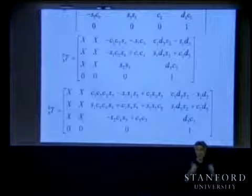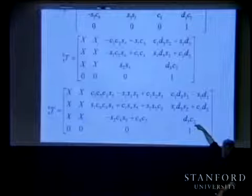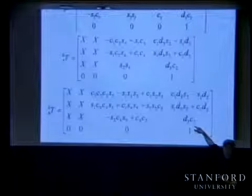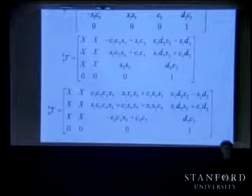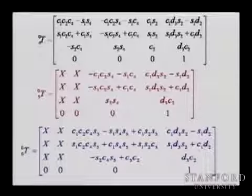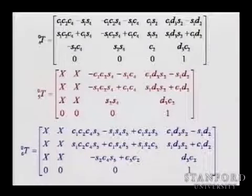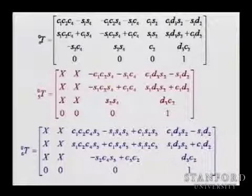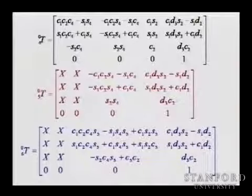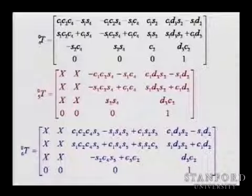You can say I would select X, Y, Z to represent my end effector position. And then for the orientation, what are you going to select? Pick something. So what options do we have? Do you remember? We had this in the first lecture, I think, or second lecture. We have angles, like 3 angles, quaternion, Euler angles, or direction cosines.